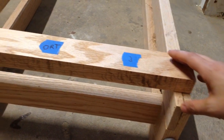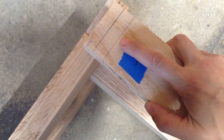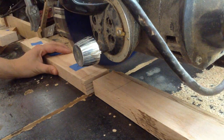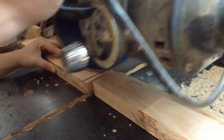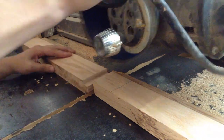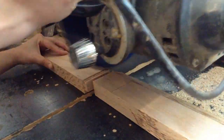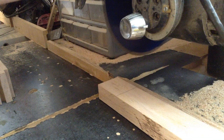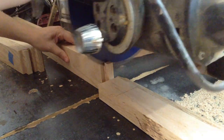This is the piece I'm going to be using on the side, and for this I'm going to do little stub mortises and tenons into the sides to attach it. You can see I marked the thickness of where that lumber is. I'm doing about a half inch, so I'm going to cut off the excess — that first outer line was excess — and then it's a little half inch stub tenon. I'm cutting these on the radial arm saw. You can flip them over real quickly. I set up test cuts to get it accurate. Then I'm also going to cut off a little bit of the top of these because I don't want to remove a ton of my corner, so by cutting off a little bit of the top I don't have to make as big of a mortise.